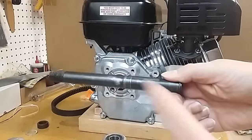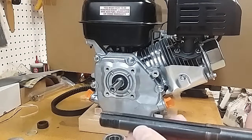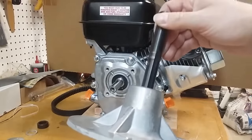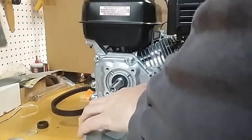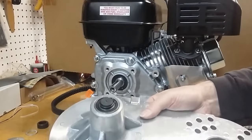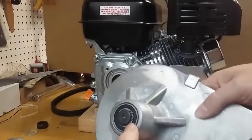Taking a look at our driven shaft, you'll notice it has a very slight step-down. The back side has a circlip on it; the other side is threaded and slotted. We're going to insert that threaded end — the small end first — through the back of the plate. It will be loose in the back bearing, but as we insert it and come up on the step, it becomes a press fit. It's just a little tight and goes so far then stops, so we'll give it a very light tap of the hammer. That seats the shaft against the bearing race with the circlip.